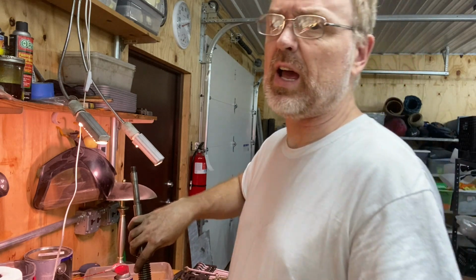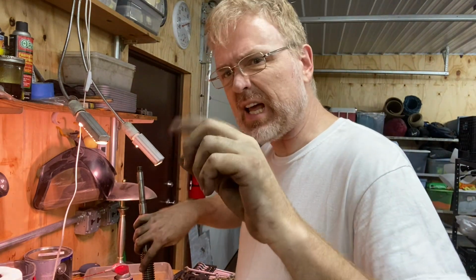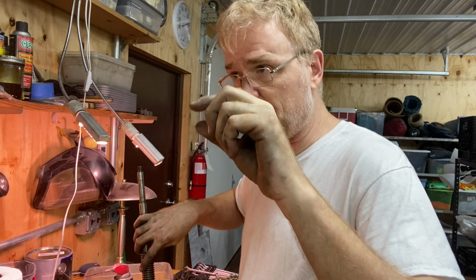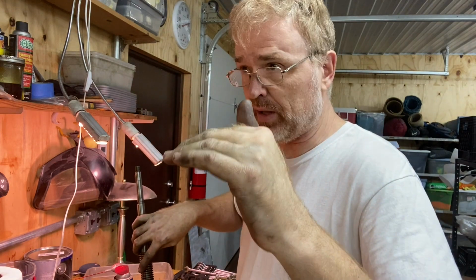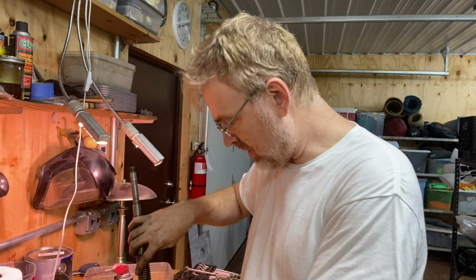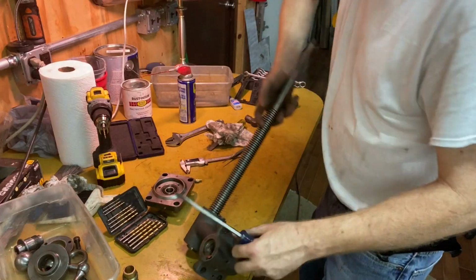Okay, I think I've got it. I ended up taking off only 150 thousandths off of that end because I decided it didn't have to be an even multiple of the pitch. It just had to be a little bit deeper for that screw to kind of have ability to sit down in that seat, in that well here. I'll show you just a second. So now it slides nicely and I'll show you how I can take out the backlash. I've got it in there.